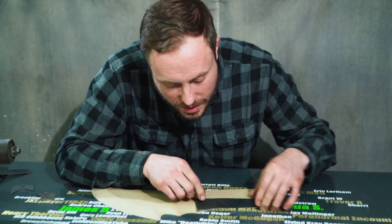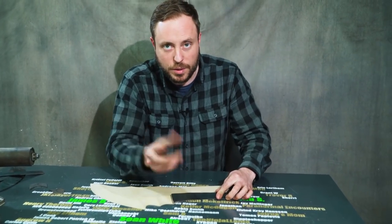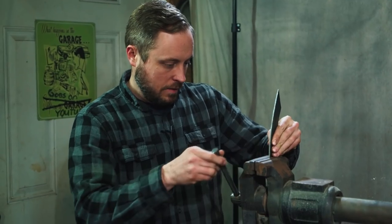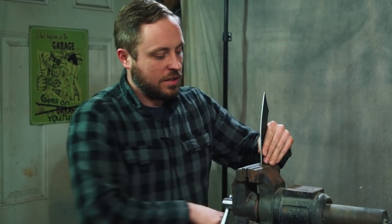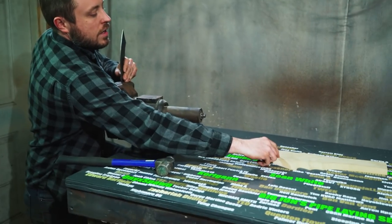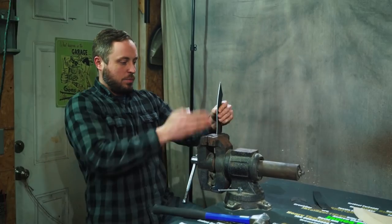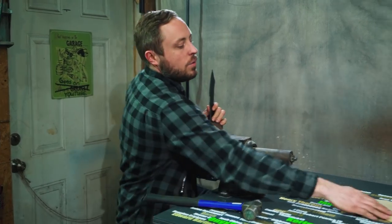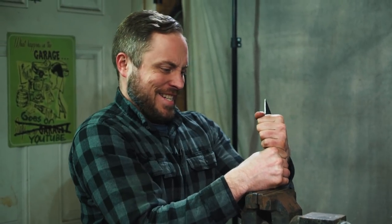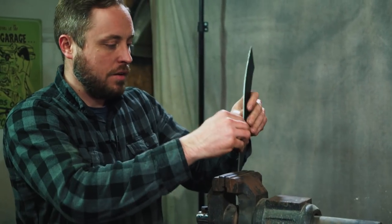This is a little more bend than it needs, but that will make it easier to pull it together with the other side of the blade — instead of having to push it, I can just pinch them. This might look like I'm just randomly bending, but there's actually some reason behind the bends I'm making. This curve is even with the perpendicular line of the two edges of the blade. Basically if I put this vertical to the two edges where they meet the jaws of the vise, that will curve the blade in the way that it needs to be curved.